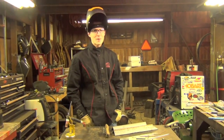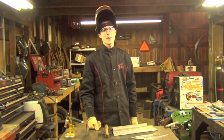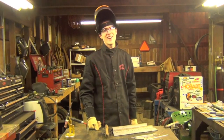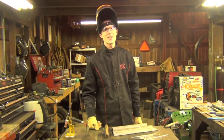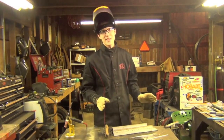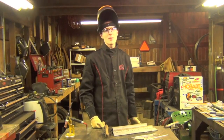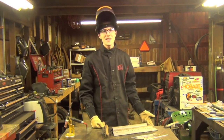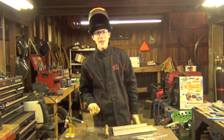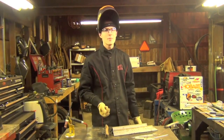You're watching part four of my Teach Yourself How to TIG Weld series. The first thing we'll be talking about in this installment is out-of-position TIG welding. If you're going to be running TIG out of position, you're in luck, because the gas tungsten arc welding process is one of, if not the least, position-sensitive of the common welding processes. One of my teachers said that TIG doesn't really care what position you're in so much, and I'd say that he summed things up well.